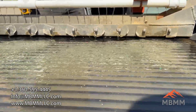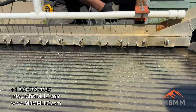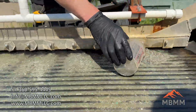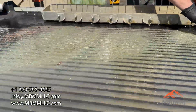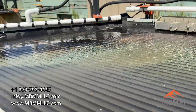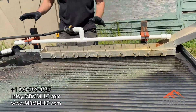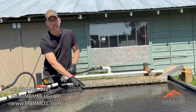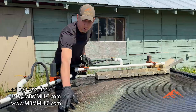I'm going to pick out any larger pieces because we don't need those in there. Right away you can see the fiberglass washes away fairly quickly and works its way down mostly into the number three. I just set the table up and this is the first run on this table, so we might need to do a little adjustment, but right now it looks like it's working pretty good. All the metals come across and they're working their way up the cleaning plane, getting mostly clean metals here and fiberglass down here.